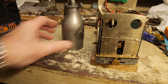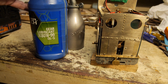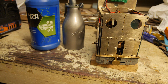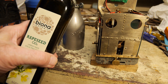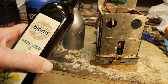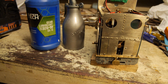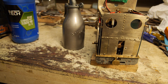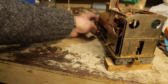For oiling the locomotive, I get the thickest oil I can, which is this — it's 80W90, it's gearbox oil, I buy it from my local box store. And then I add a little bit of rapeseed oil, which was recommended by a guy on YouTube. It's apparently a long string molecule and it just helps the oil stick and bind and not be thrown off the bearings, because in steam engines oil gets thrown around quite a bit. I used to use sewing machine oil and these thin oils which a lot of guys recommend, but I found that the parts wore out much more quickly, so I've stopped using those.